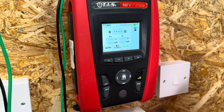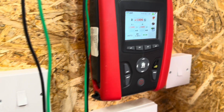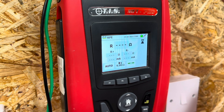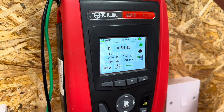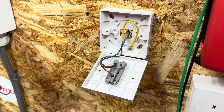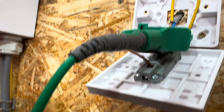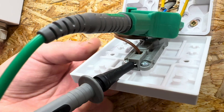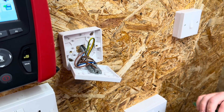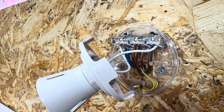I have an open circuit — this could be a break in the CPC or a break in the line conductor we are testing. Let's think about where we would naturally break the line conductor: at the switch. Operating it, I get a nice low resistance because I've now closed the circuit. Now I need to test at the switch to prove that the CPC is continuous to this part of the circuit before I move on to the next light. We don't need to operate the switch just to make sure that we have a protective conductor at this point.